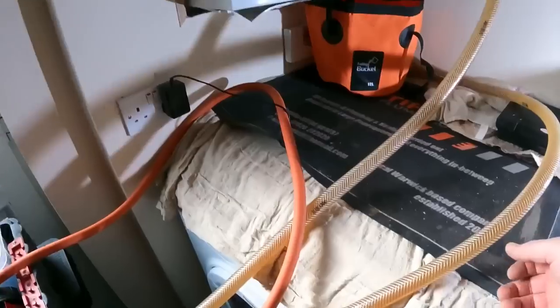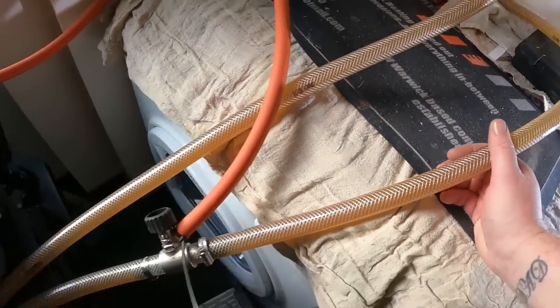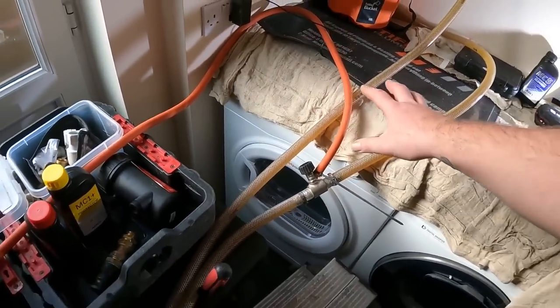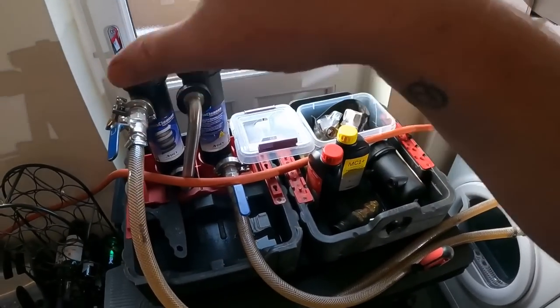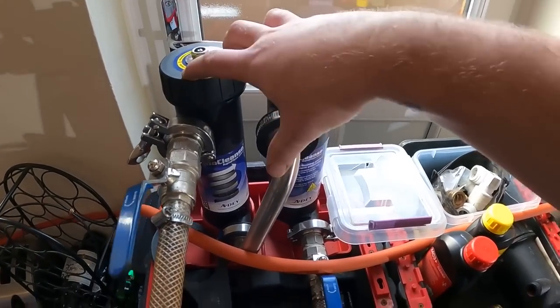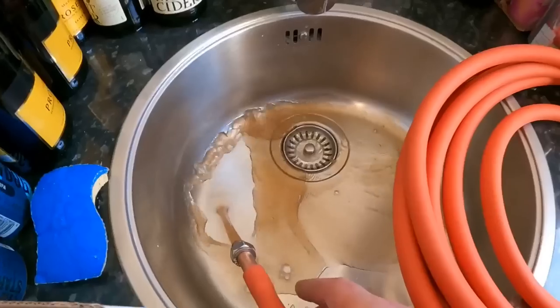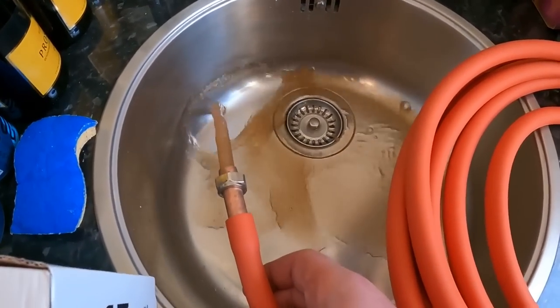So we've had this running now with the MC5 in it, and you can see from the hoses, the water, the colour of the water inside the heating system is still pretty minging, because this isn't a flushed through machine. This is to just catch all the magnetite, which is doing fine. So if we open up this drain, you'll see just what the state of the water is.